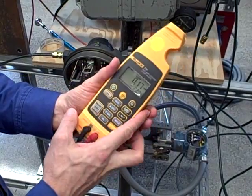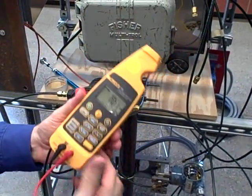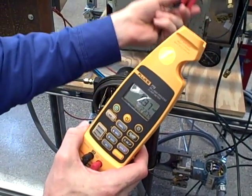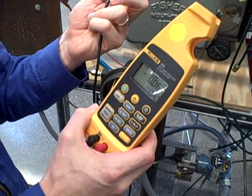So how do we measure current? We do it the old-fashioned way using leads, but not with the clamps. Before you use a meter like this, it might be a good idea to do a quick sweep or survey and look for magnetic fields with the clamp, and make sure you're not about to walk into a condition that's going to cause gross errors.